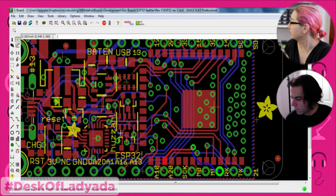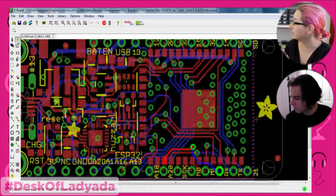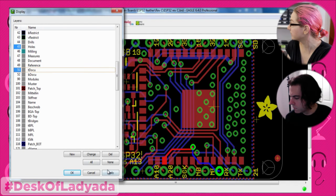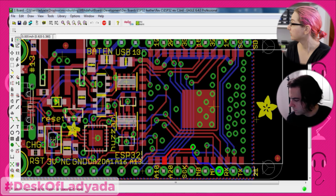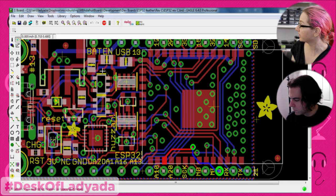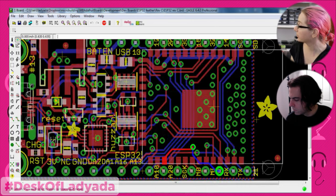Okay. Yeah, one of the changes I made is, over here I have individual resistors, and some of these resistors ended up not being needed, so I changed them into a resistor pack. You can see this resistor pack up here. That saved me a ton of space because essentially I went from 603s to 402s, and I love these resistor packs. They're really great, so all this has squeezed down quite a bit. And then over here, I'm also replacing three or four resistors with a resistor pack.